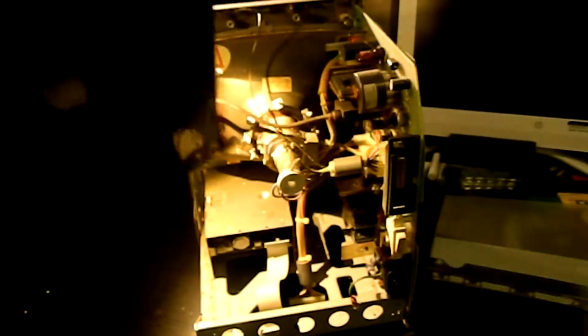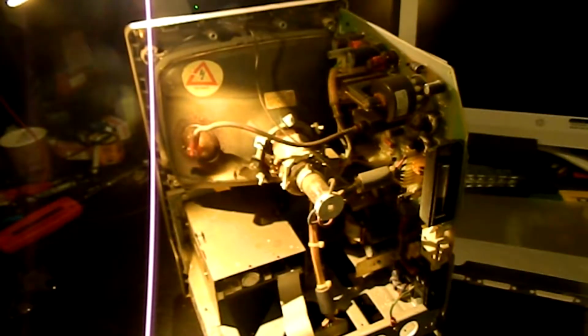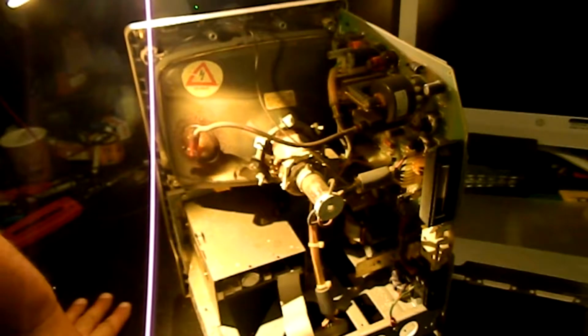So anyway, the idea here is that I'm going to use this piece of black plastic, and I'm just showing you that it does in fact cover this whole space, and I was really lucky that I didn't put this hole somewhere else. That piece is going to go where the CRT used to be, and then there'll be a square hole cut in it for the monitor, which will be just a simple LCD monitor. The interesting question is, how am I going to mount the drives? Cooling is going to be a real problem in this project because the Mac Plus was, and early Macs were, not actively cooled. I think I'm going to have to play that one by ear. I don't really want to put a fan in it if I can possibly avoid it.